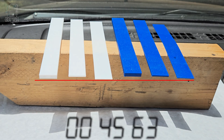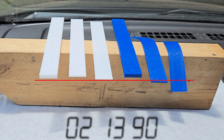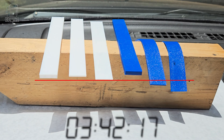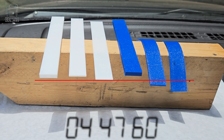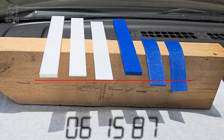After things stopped changing, we brought in alternate test blocks in both materials at 1mm, 2mm, and 5mm thickness. Once again, PLA moved first and really did fold quickly and easily in the heat, leaving a lot to be desired. PETG didn't come away unscathed, but it really did hold its own.